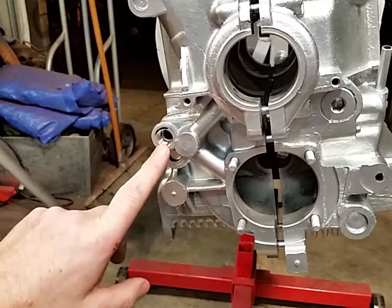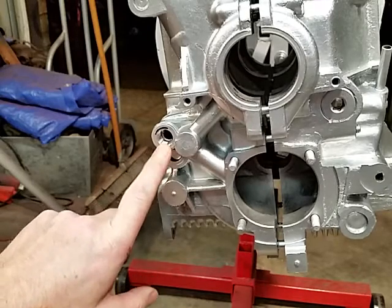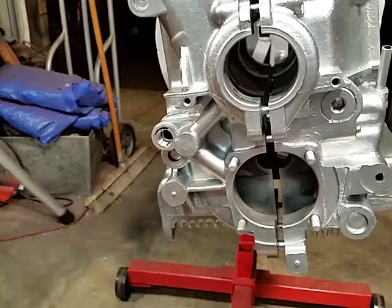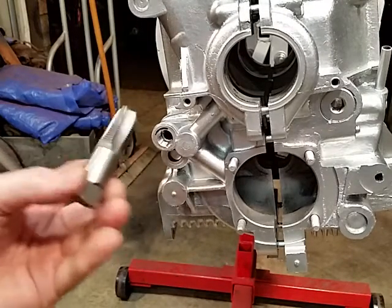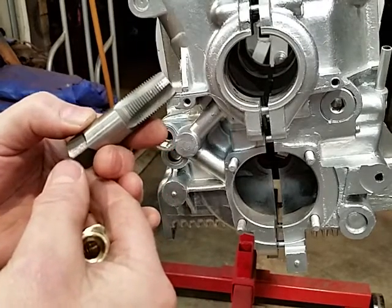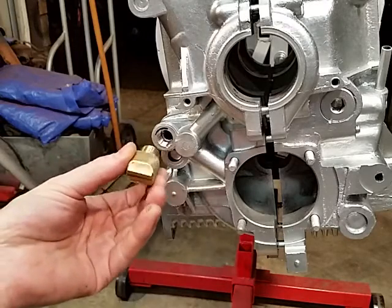That outflow is not usually on the case. I just went ahead and did what his video said and drilled with a 9/16 — you can actually use the 37/64, I think that's what he goes through, but I did it 9/16. Did it by hand like he said, went ahead and tapped it with this 3/8 NPT, which is a tapered pipe threader tap.